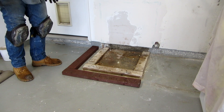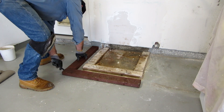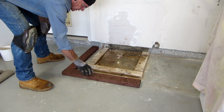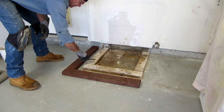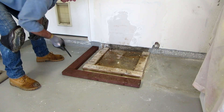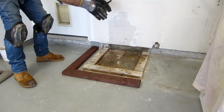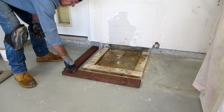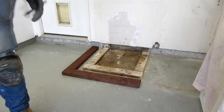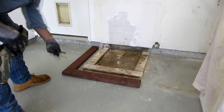I've laid out my floor pad here and I've got my wood cut, so these pieces will just sit in here. I'm going to leave the existing base in place because it's shot in with a gun. I'm going to shoot these into the cement so they're solid, then build my platform over this — I'm going to double this up this way and that way. By the way, this is treated wood — you can't shoot into regular 2x4s, it has to be treated.